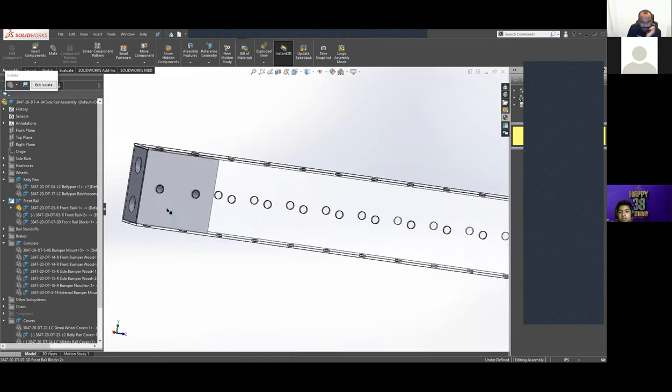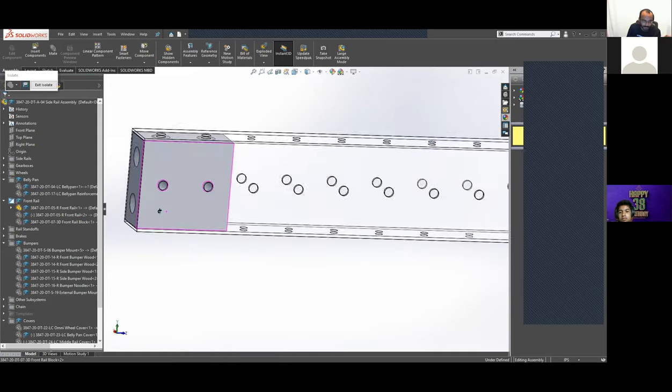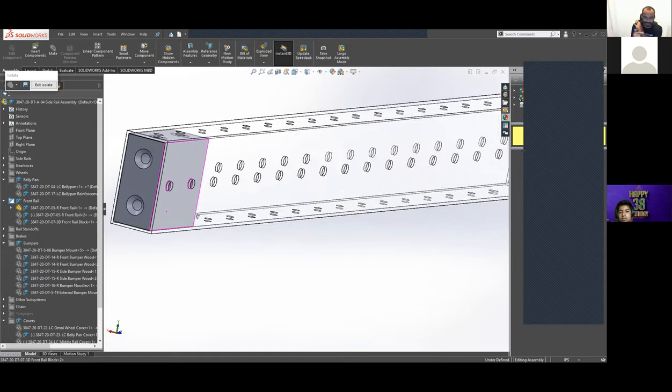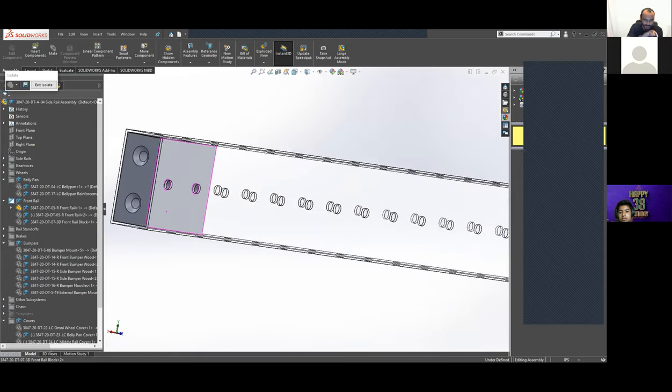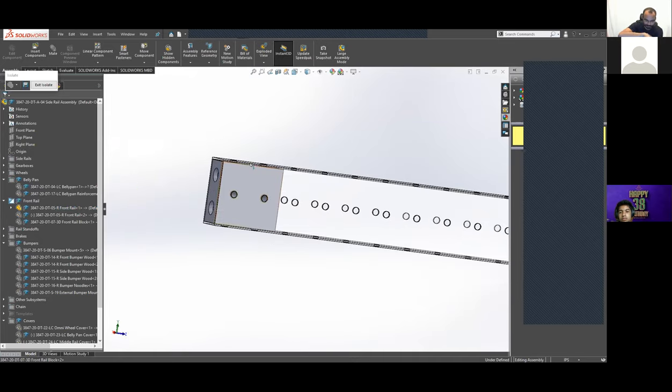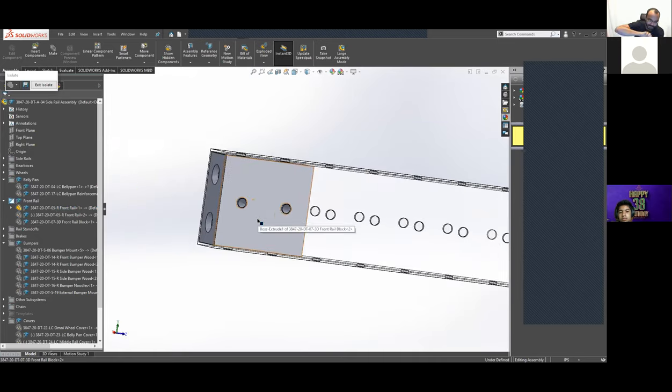So you would only ever assemble this robot by putting the threaded rod through one way and never the other way. If you try to put it through the other way, it's almost impossible to get it to go through the holes. But if you put it through the way that has the concave or countersunk holes in both sides, it locates much, much easier.